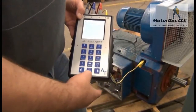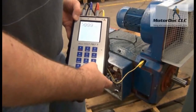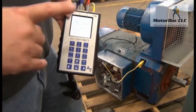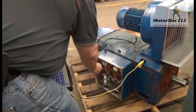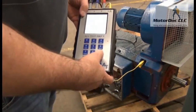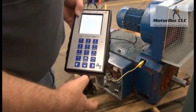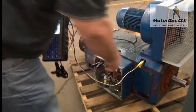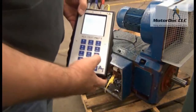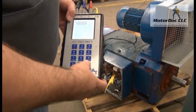Press OK and then press and hold down test. Over a gig ohm. Press OK. Then it says connect the blue clip to armature, which means field. Press OK. That's my test, done. Press OK. Then it tells me to connect the blue and the yellow between the armature and field. So I press OK and go ahead and perform that test as well. Press OK again.